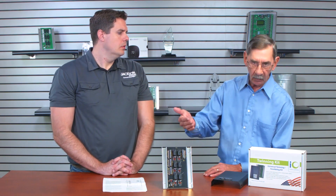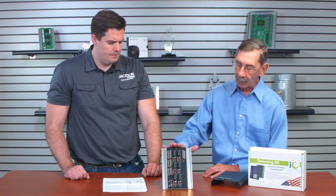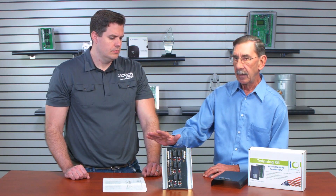We're just a switch — dry contacts: R to Y, R to W, R to G. That's probably the most common issue we receive here at Jackson Systems with technical support. The tech calls in, and you ask him, did you isolate this twinning kit from the equipment transformers? No — we used one of the transformers, and we keep blowing fuses. The reason is a phase problem, because we're also trying to switch another transformer. So always make sure you isolate this. Use a separate transformer — 24-volt, 20 VA or 40 VA. It doesn't take much to power this and a thermostat, and now we're totally isolated from the equipment.